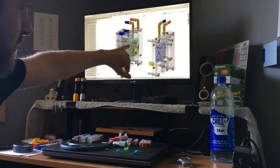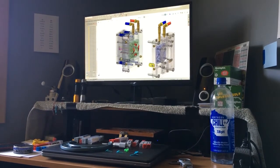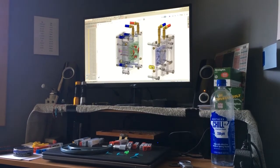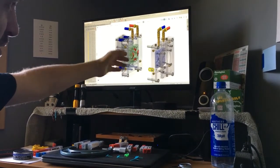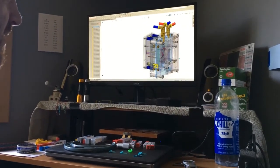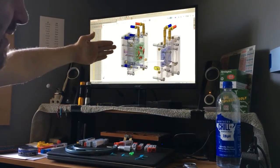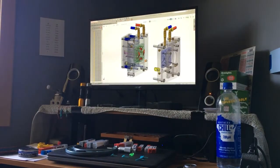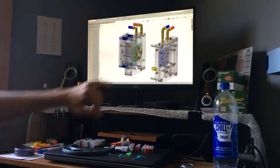Starting the design, we have a four-cavity tool here. We want to find our orientation so we have enough steel between each cavity, keeping the tool safe and giving it longevity without blowing out the walls. You'll notice these different colored pins — those are the ejector pins. When the tool opens, the tool molds the part, then opens back up and the parts have to come across with the moving B side and get ejected off. If they get stuck in the A side, that can cause a collision and could be catastrophic to these more intricate tools.